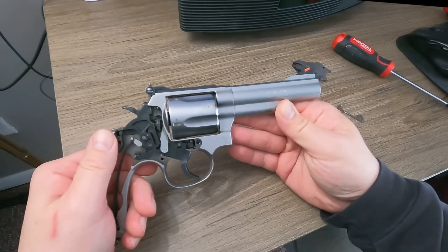If you let off the trigger and just let the hammer drop, the transfer bar drops out of the way. What makes this safe is that the hammer can never reach the firing pin on its own — at the top of the hammer there's a little knob that's behind the frame and stops on the frame, so there's always a void between that hammer and that firing pin. This design means the gun could never fire without the transfer bar. The hammer has to hit the transfer bar, and the transfer bar hits the firing pin. This is a completely opposite design from Smith and Wesson, and a lot of companies use it — Colt, Ruger, Charter Arms, and Taurus.